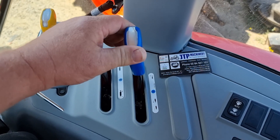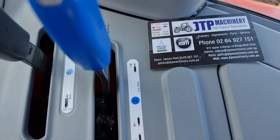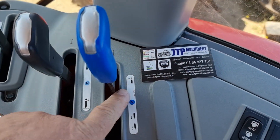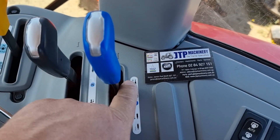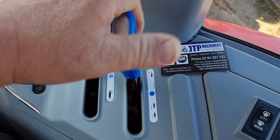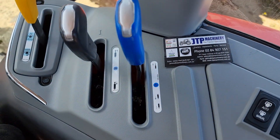Let's look at this position. We could activate a ram — there's a little picture of a ram there — or hydraulic cylinder, to be technically correct. If I push it that way and have that hydraulic coupler connected to one side of the ram and this coupler connected to the other side, when I push it this way the ram goes out; that's neutral; when I push it the other way, the ram goes in — or vice versa, depending on which way you plug it in.